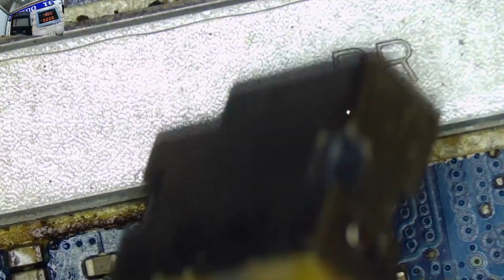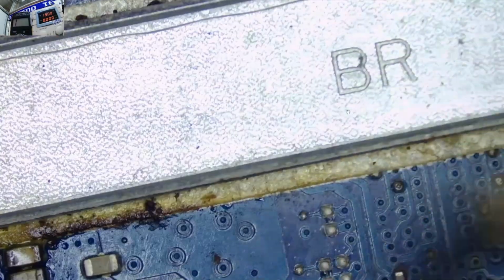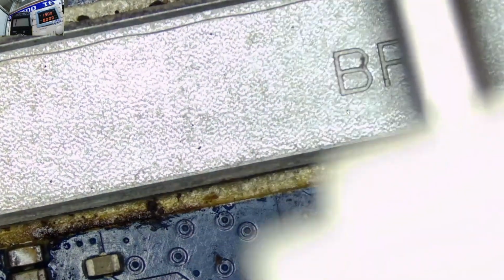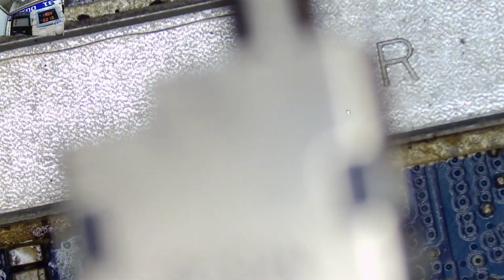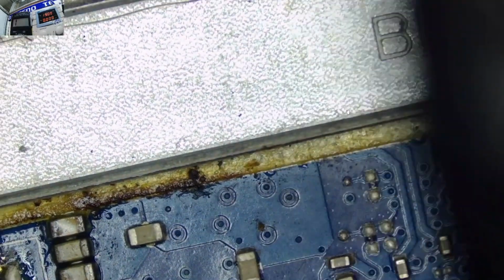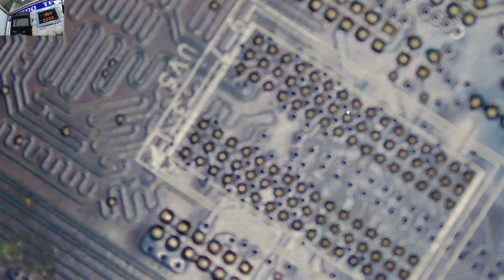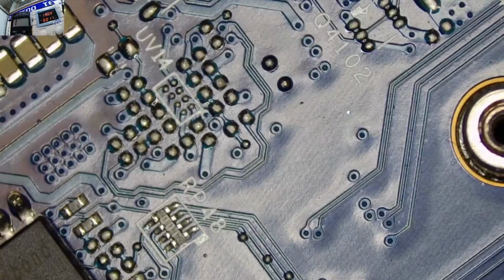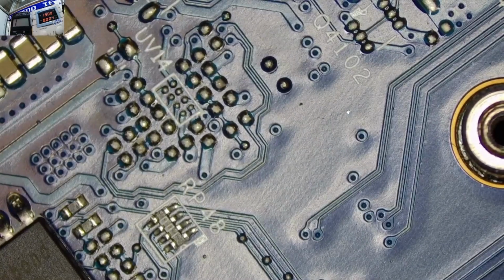Yeah, let me try to put the charger. Let's check under the power supply. Look there up on the top right corner. Yeah, the white light on the charging port. So let me try to short the power button and see how many amps are being drawn by this motherboard here. 0.11 amps when it's off. Let me put it on.